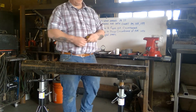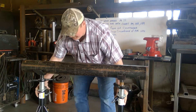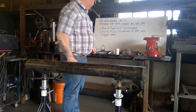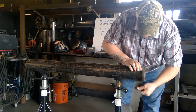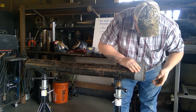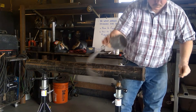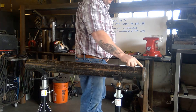We're going to measure out a 20-inch piece of pipe. You can see that the end of this piece of pipe is not square to the wraparound, so we're going to make a reference line on the end of the pipe using your wraparound. Now we have a square line and a reference to pull all our other measurements off of.